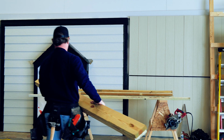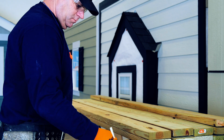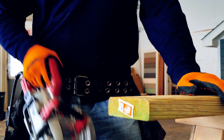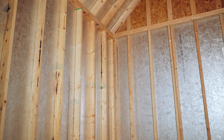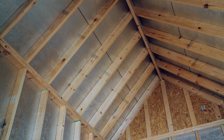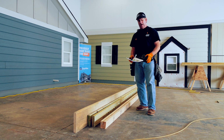We want to take a quick second here to explain some general carpentry knowledge to the general audience. And that is that when we're laying out our floor joist and getting ready for the base of our building, we want to look at also that layout is going to actually carry over from the floor through the walls and up into the roof. So essentially, think of it as like ribs, where the floor joists line up with the wall studs and then line up with the roof. And you'll see that when it's done, but if you can imagine it now.